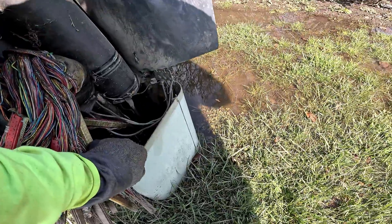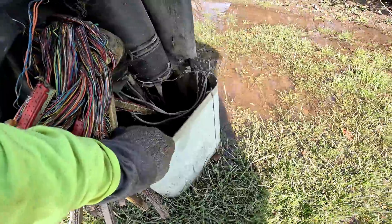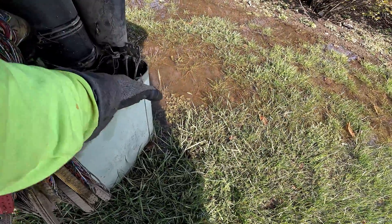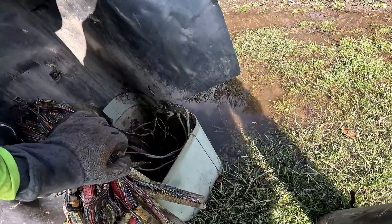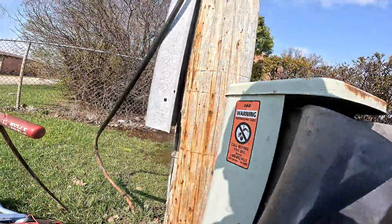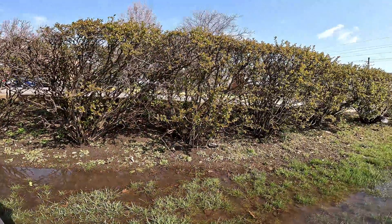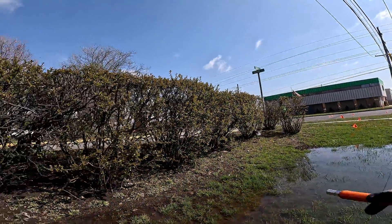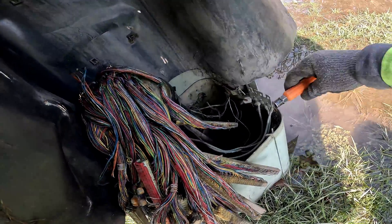Alright, counting my ground straps — I got one, two, three. I got four cables in here plus the splice. This hundred-pair right here must be feeding the property over there, so I'm not worried about it. I need two 600-pairs: one goes from here to that building, and one goes out to the road.